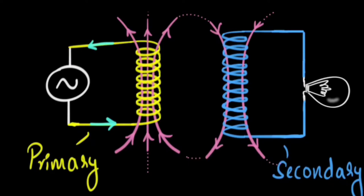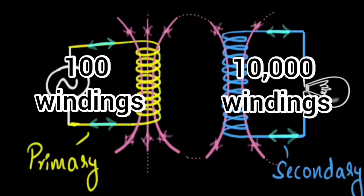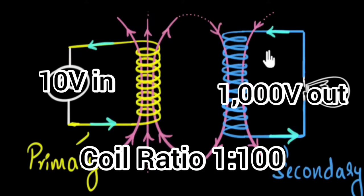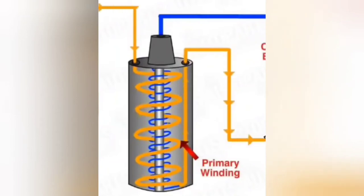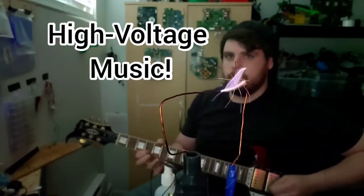Let's make that ratio bigger. Say we have 100 windings on our primary and 10,000 windings on our secondary — that's a ratio of 1 to 100, meaning 100 times more windings on our secondary than our primary. So the input voltage would be multiplied by 100 on the output of our secondary. That is essentially how an ignition coil works. So all I did was build a circuit that takes a signal from a guitar or piano and puts current through the primary windings of the coil at the same frequency as the audio signal. That makes the high voltage arc occur at the same frequency as the audio signal, making the sound from the guitar or piano come out through the high voltage arc.